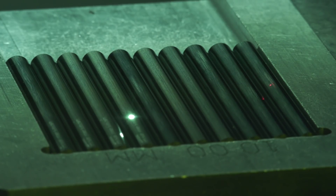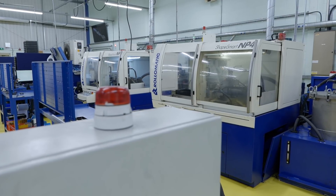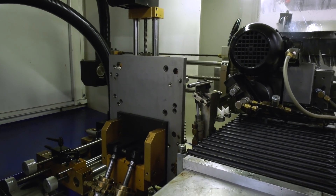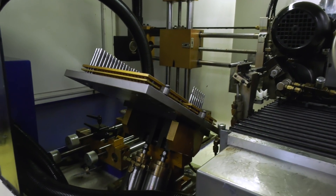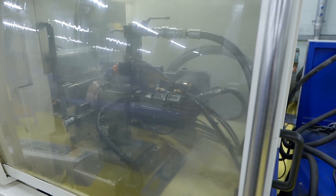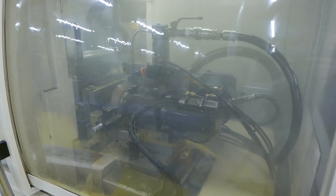What's this next stage of the process? These are the blank prep machines — the Roll-o-matics. They change the blank from a cylindrical shape into all different shapes and sizes before they go on to the flute grinders for cutting the geometry. We automate all of our machines because we're very busy — producing tens of thousands of tools every week. Batch sizes range from one-offs, which isn't ideal, all the way up to five thousand.